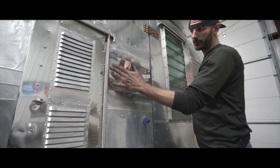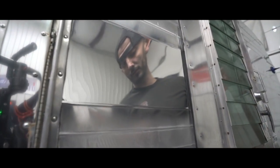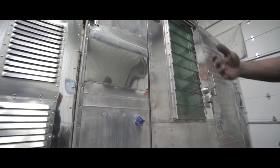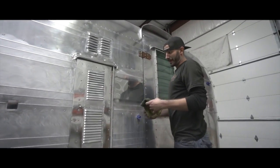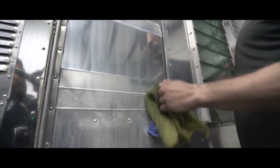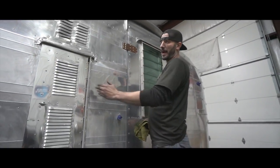That just adds a lot more color — it's real bright. The big scratches are still there but the small scratches are gone. You don't want to take it all the way down; it's real thin, and it adds to the rustic character of the piece. Now we'll wipe it down again and get it ready for the flannel step. Drop down to the flannel and the blue moon compound — this brings the lines a little tighter together. Leave the compound residue on there as a cheat sheet so you can see exactly where you're at.